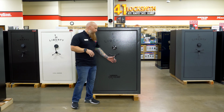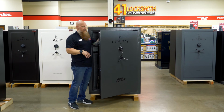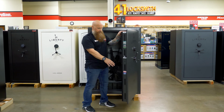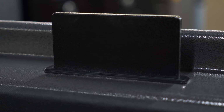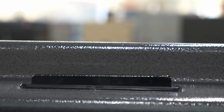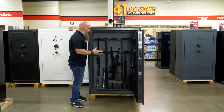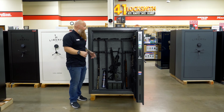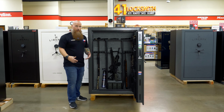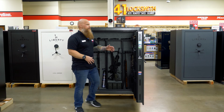That is important. If I give her a turn, we'll pull it open. This has bars on 3 sides of the door. Those are 1/4 of an inch thick, and there are 8 of them total from the manufacturer. When I close the door, those bolts stick out. They're flat, 1/4 inch thick steel, almost touching all the way up and down the door. That's really important for pry protection, which is the most common way in.